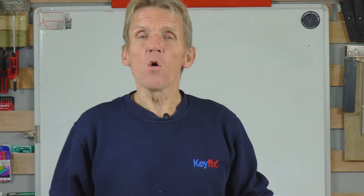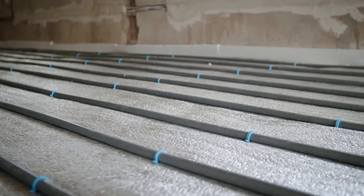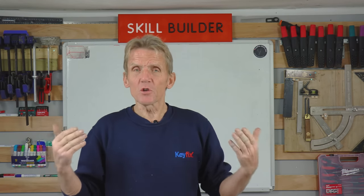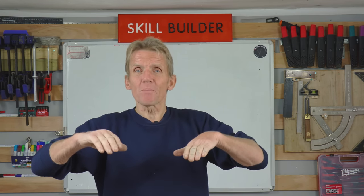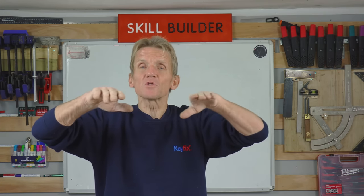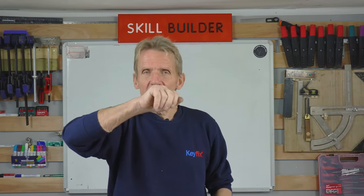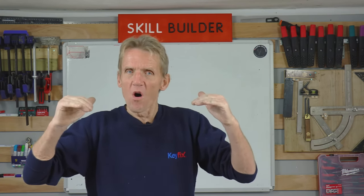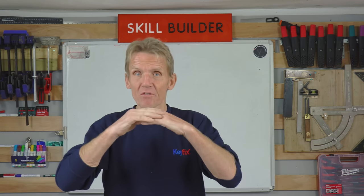So under each space between the joists was this central heating pipe running up and down. When you go in there, all you feel is a nice warmth — the tiles aren't cold but they're not over hot. The reason they're not over hot is because the pipe isn't in contact with the floor surface itself. If you have the pipe without direct contact with the floor it's fairly inefficient. If you were doing underfloor heating properly, you'd want the pipe pressed hard against the floor surface using aluminium spreader plates between the joists — but those spreader plates have to be pushed hard against the underside of the floor, and they can sag slightly if not well tensioned.